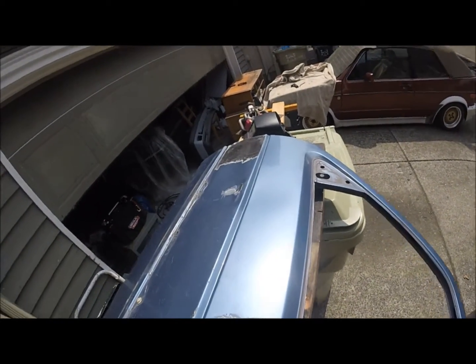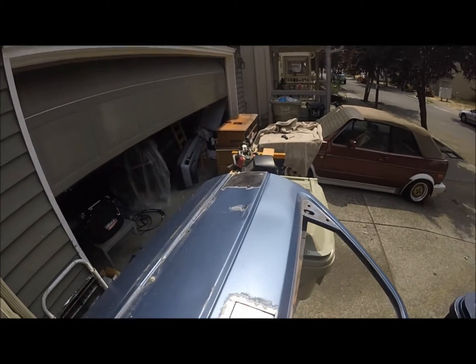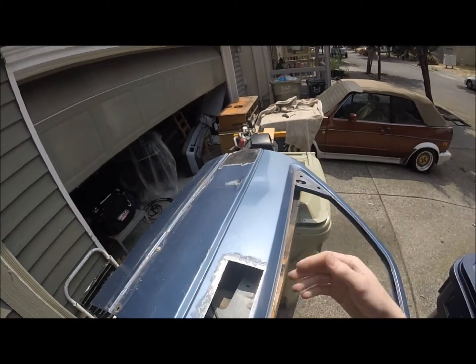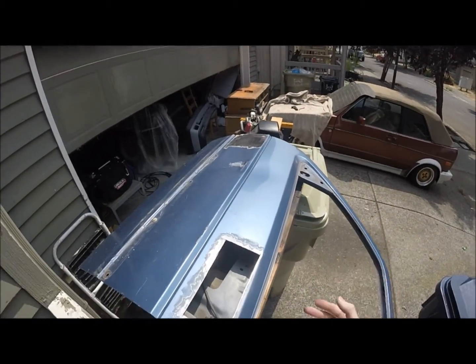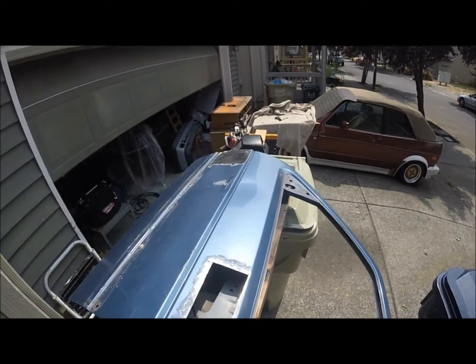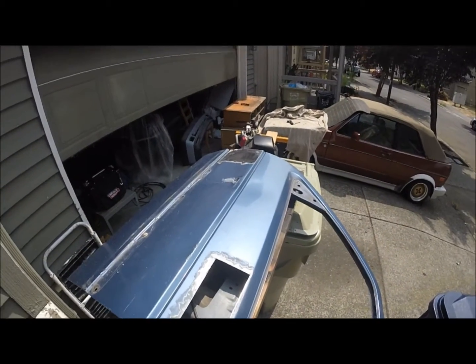be sure that you have a 1/16 to an 1/8 inch gap all the way around your piece. You need that little gap for the weld to deposit into, because if it deposits on top, there's more grinding and less penetration, and that's just a worse weld. So leave a little space and you'll just get a whole better results, and it'll save you a lot more time.